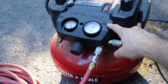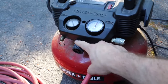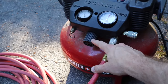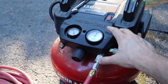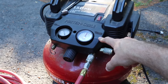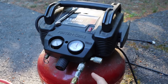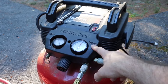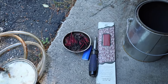When I say you can build a smoke machine for under 10 bucks, I'm assuming you have access to an air compressor. This is a six-gallon Porter-Cable air compressor with a regulator, which is super important because you're going to want to greatly reduce the air pressure, or else you'll blow things apart. If you don't have a compressor, this is not going to be under 10 bucks — I paid something like $150 for this one 10 years ago, so just note that it's not included in the $10 price.